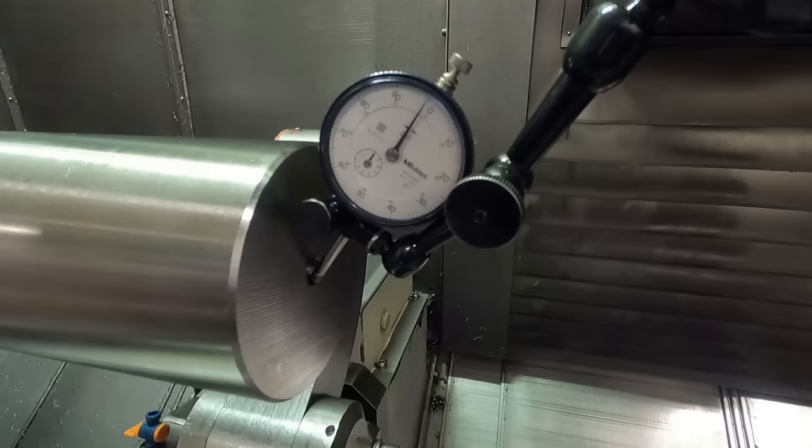Okay, let's get rid of this tailstock here. We gotta, again, grab a hold of that dog with a shot pin. There, we engage it. It's got some kind of sensors behind the way covers that sense when it's in the right location. You put it in what they call a tail body connect mode on the control here, and then you can jog it with the jog key until it knows when it's lined up, because you can't see it back there. There's some kind of proximity sensors in there that can tell when the tailstock is lined up to the dog. You see the dog right there.